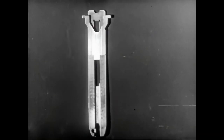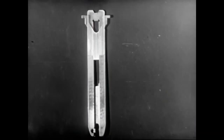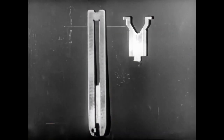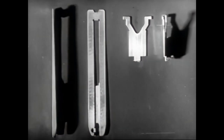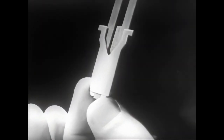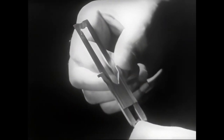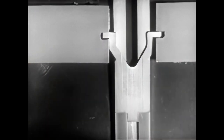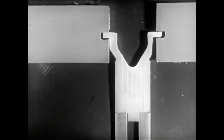The spaceband consists of two parts, the tail, a slide, and the small head. Both are wedge-shaped. They are held together by a dovetail construction. The small head is held stationary by the lugs in the grooves of the first elevator, so it remains fixed when the corresponding slide rises. In that manner, the expansion of the spaceband is obtained.